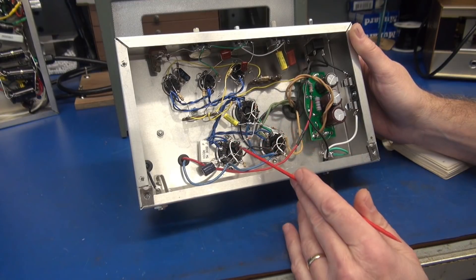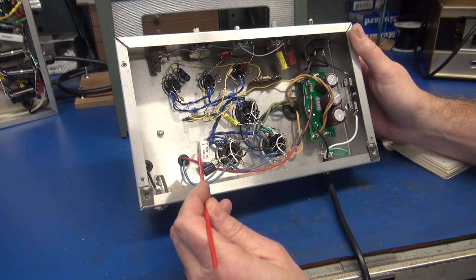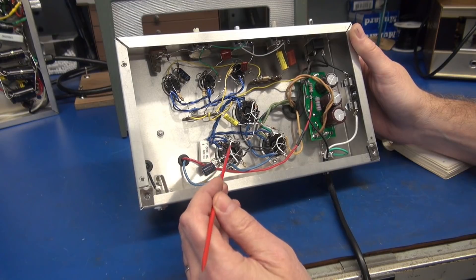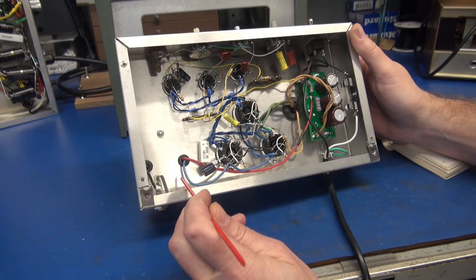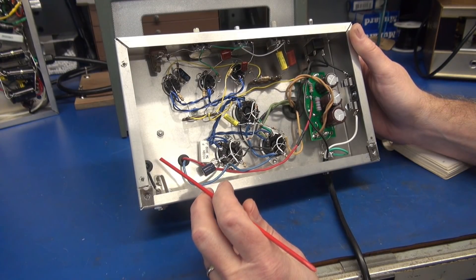This circuit works really well. Over here we've got a cathode resistor for our bias — it's a 300 ohm resistor. There's only one and it's strapped to all the cathodes with a bypass cap: a 100 microfarad 50 volt cap. There's my speaker output. That's pretty much the guided tour of the bottom side.